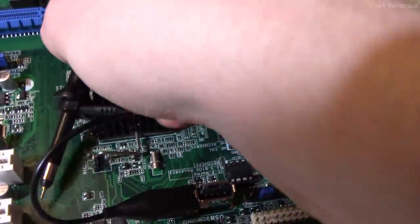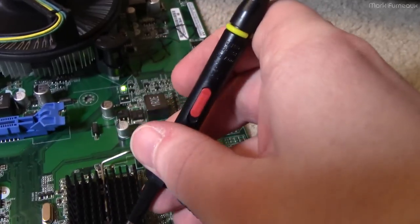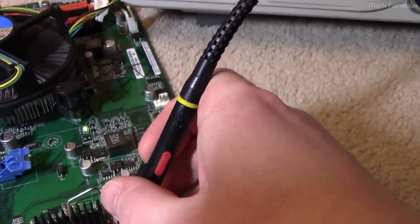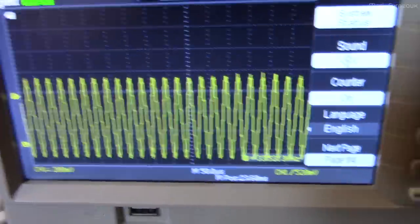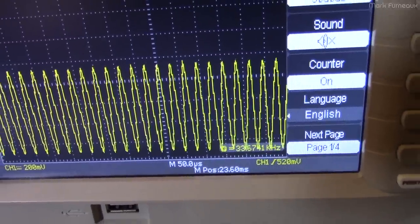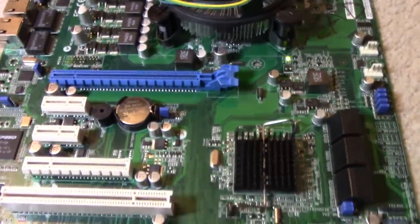While we're at it, we'll check the other one — that's going to be 32 kHz, so I'll have to change the time base way out in the other direction, because it's going to look like DC at the current time base. There we go — we can see there is some signal on there. There's a nice signal and we see about 33 kHz, roughly. I don't fully trust the crystal in this scope, so the crystal on the board is probably more accurate. That's our RTC oscillator running. So both of the crystals are running, which means we have all of the clocks that really matter for this board to work — that is not our issue.